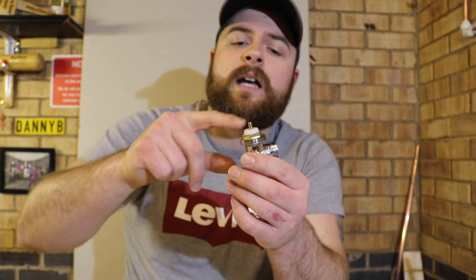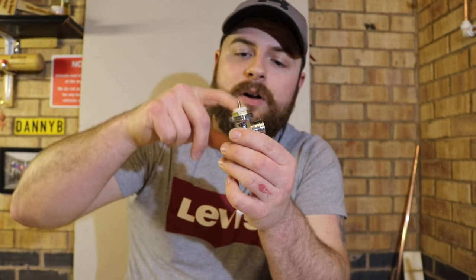I don't recommend hitting it with a hammer. I've seen a few videos explaining to people to do that — I don't recommend doing that. There are ways around it and I will cover that in another video, but do not hit it with a hammer, because what can happen on some valves is this pin here can pop out and before you know it, you've got a fountain of water coming out under pressure, squirting all over your nice paintwork. You don't want that.